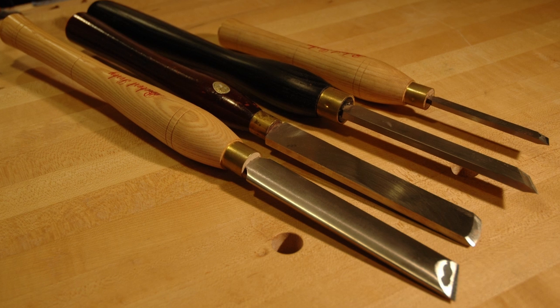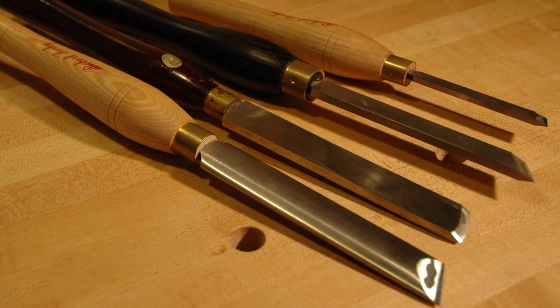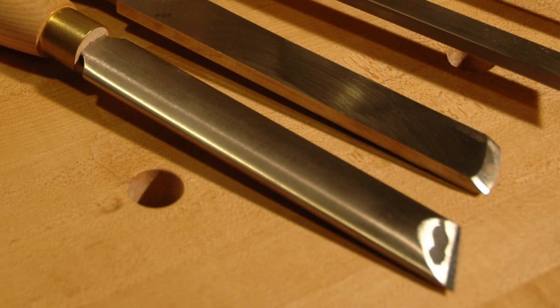Over the years I've bought all different styles of these skews — I really did want to learn to do them right. I finally ended up preferring a flat straight beveled three-quarter inch skew for one simple reason: it was the only one I could reliably get sharp, and a sharper tool is your best tool. I really sucked at sharpening the oval one because there isn't a place to really rest it. Being oval, it wants to roll around on you and that made it extremely hard to do scraping cuts on the lathe.